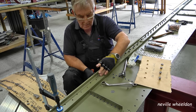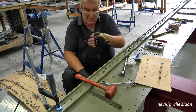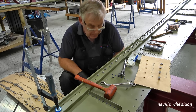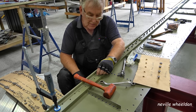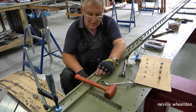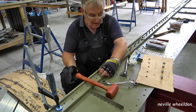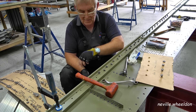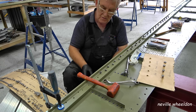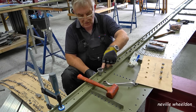What is that, about a couple of thousandths clearance on the holes there then? Yeah, they're just transition fit aren't they? Not interference but... well I suppose they are slight interference fit. Because transition is a sliding fit. But these are just... it must be a thou or so. Not a lot.